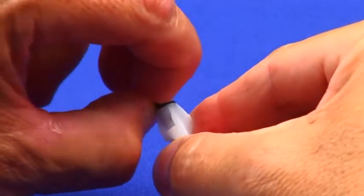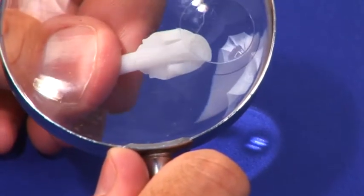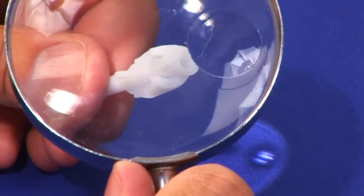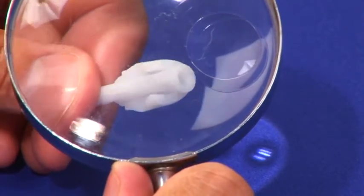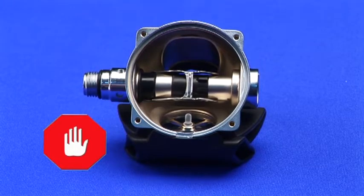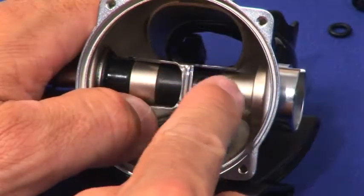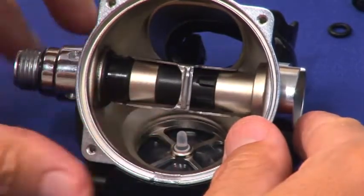Pinch and separate the low pressure seat. Using a magnifying glass, inspect the poppet shoulders for any signs of wear due to cam action. Though rare, replace if needed. The lever need not be removed. Visually inspect the lever to be sure an inexperienced technician hasn't bent it previously. The lever should parallel the inlet tube from end to end.